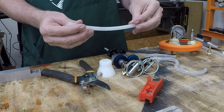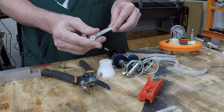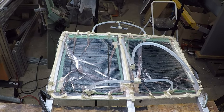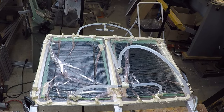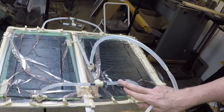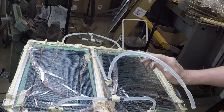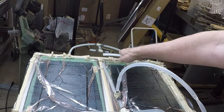This particular sample is 1/4 inch on the inside and 3/8 of an inch on the outside diameter. For the samples that I've been making, this is a perfect size of tubing. It does not restrict any of the resin flow on the input side, at least at the flow rate that I'm using, and it does not restrict airflow on the vacuum side.